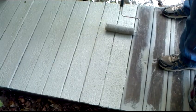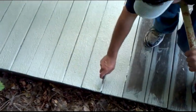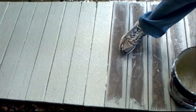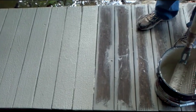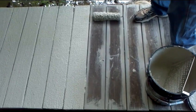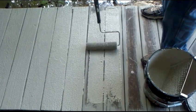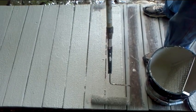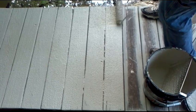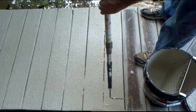This is the first coat and now you can't even see that board. It's a good sized dunk but you don't have to completely saturate it. Push the right side in, push that out, smooth to the edges. These boards are three feet wide, so this is about how much you're going to be able to get out of one roller load consistently.